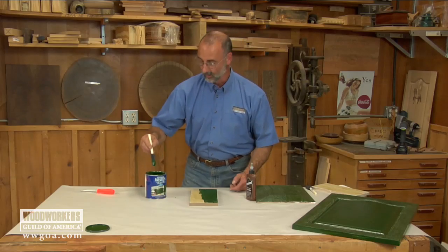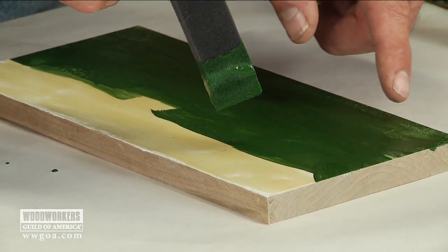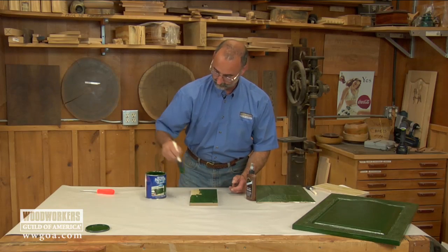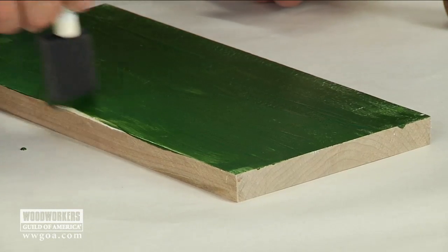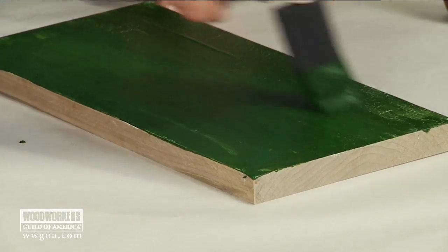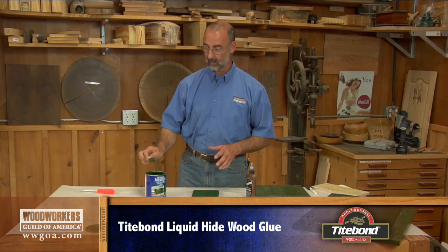You want to resist going back and touching up the spots where it's starting to crackle over the hide glue. Look right here on this front corner — see the spiderweb is forming already, and it's just seconds since that paint went on. Let's give that green paint just a couple of minutes to dry and we'll come back and have a look at how it crackles.